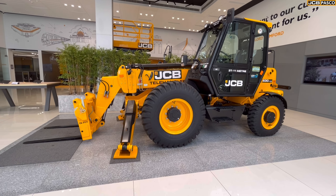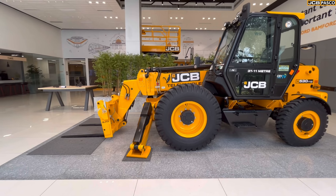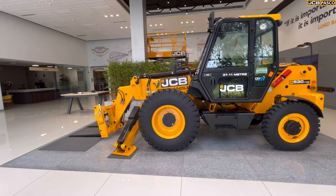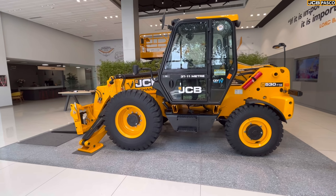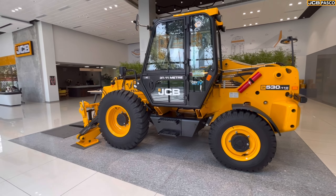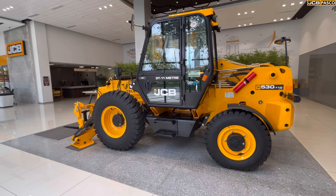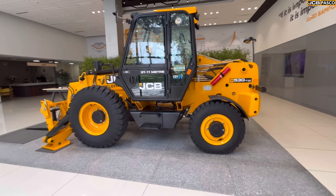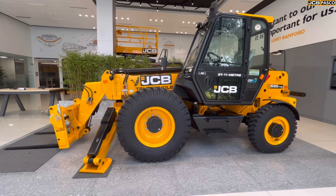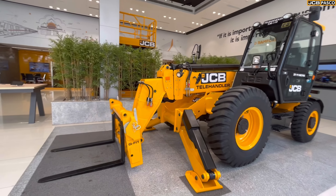The ground clearance is about 0.40 meters. It is supported by 2 hydraulic jacks during operation. The machine is very big in reality — its weight is 8,870 kgs. The front tires are 13.00 x 24-16 PR and the rear tires are 12.5 x 18-12 PR. The tires are so big that JCB manufactures them in-house, not through any third-party company.